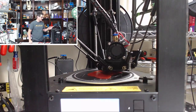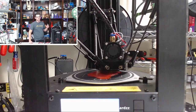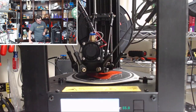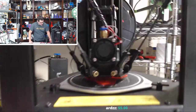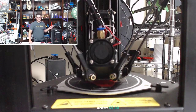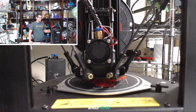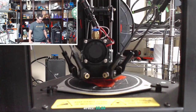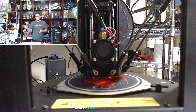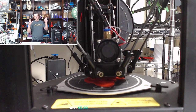But the biggest change I did on that, aside from a couple of necessary ones, is it's easier to print flexible on there now with the better extruder. There's a little bit less wobble in it now with the X gantry stabilizer on there with a 6mm rod. Now we're cooking around on the actual model. And yeah, adding the V6 on there, I have a V6 clone on there. I did have some problems with some crummy throats, but once I finally got through that, I mean, I print PLA mainly on that machine. I can print PETG if I want to, but it's mainly just a good PLA machine. I mainly do PETG on the Anycubic i3 Mega, the A10, or the Hypercube, just because those have the Ultrabase style. Well, two of them have the actual Ultrabase, and then the Super Plates on the A10.